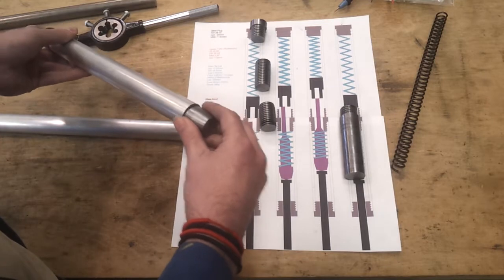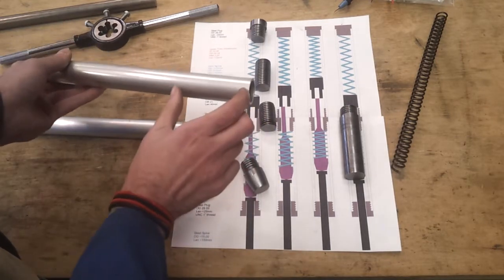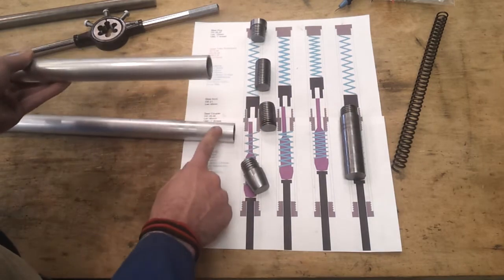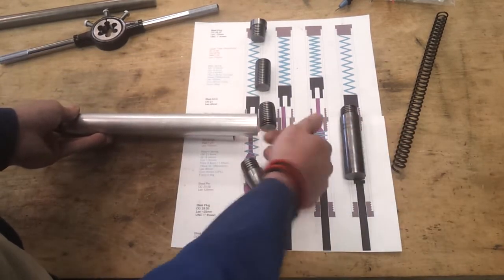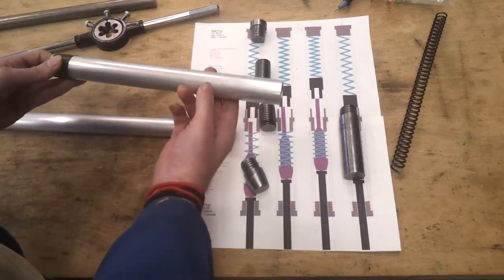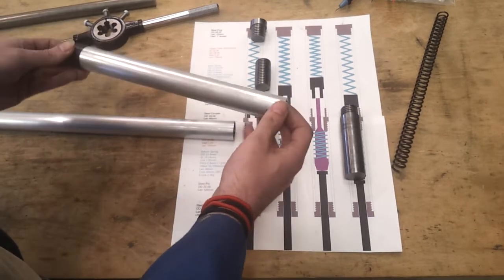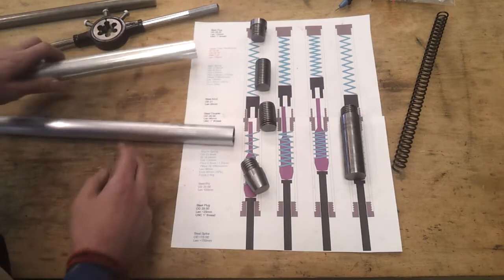What I'm going to do is use another piece of aluminium tubing I've got which is one inch internal - that's pretty much the same size as the thread and therefore the die and the tap. If I cut a piece off and bore it out so it acts as a sleeve, I can drop that over the end and use that as a guide when I'm starting to get the tap going in. I'll hacksaw that off, bore it out on the inside on the lathe, then chop this down and carry on cutting the threads.